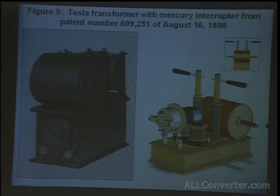This form of brake is given thorough satisfaction, working continuously with currents of from 20 to 25 amperes. The number of interruptions is usually from 500 to 1,000 per second, and the space occupied is about 10 inches by 8 inches by 10 inches.